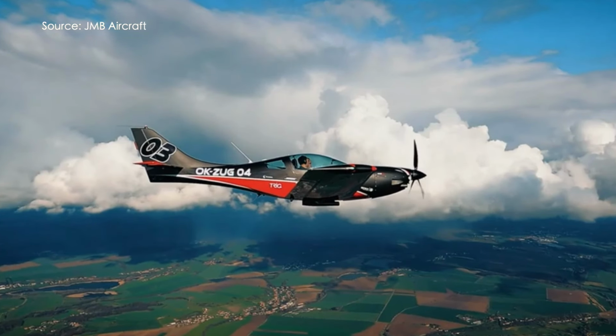So now, as you can see, we have a Dynon HDX1100 in this plane. We are working closely with Dynon in order to integrate the engine parameters into the Dynon. As you can see here, we have an engine monitor, and in the future it will disappear completely to be fully integrated in the Dynon. So this makes things easier.